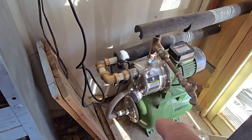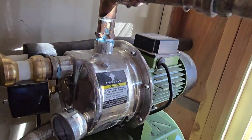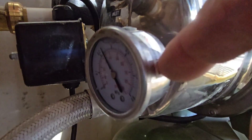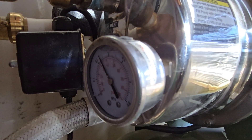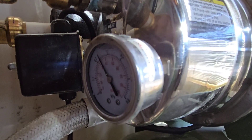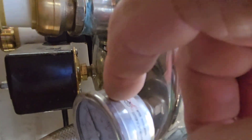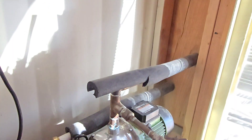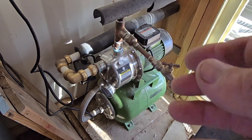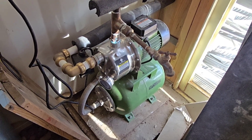He said he's leaking oil out of his gauge. You can see there's always a little air space at the top — these are oil-filled because water is going in the back side of the gauge, and if it weren't oil-filled everything would rust out and the gauge would fail. So they oil-fill them. That little nub on top of the rubber has to be cut off after installation, because otherwise you'll get a vapor lock or air lock on your gauge and it will not read properly.